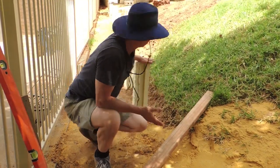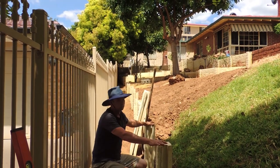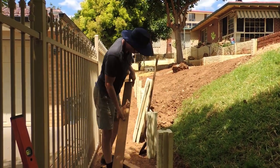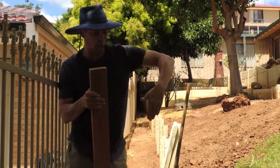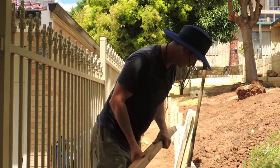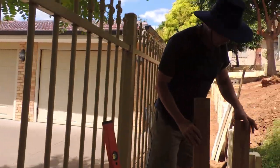When I first started doing this, I was actually taking the time to grab each one of these panels, which weighs about 30-odd kilos, and just slot them in to get my distance. They weigh a ton and it was a nightmare. So I thought — get yourself a piece of wood. I got a piece of pine panel timber I found on the rubbish heap and cut the piece of wood pretty much exactly the same length as the panel, just adding a couple of millimetres to be sure, but not too much because you don't want much of a gap. Use that as a template.